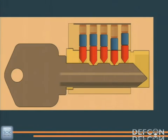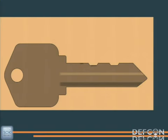That'll stay in place. So if you start wiggling now, on pin number 2 there'll still be a mark, because that was the first one preventing it from turning. But number 4 is now out of play. So another position will start giving dents, because that's the one that's correct. So other places there will be dents.